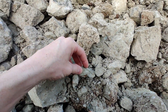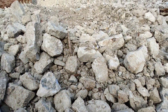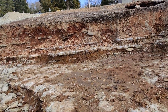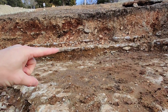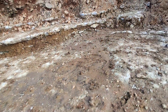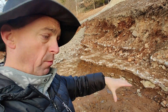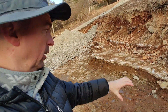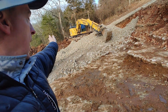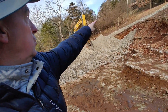This dirty rock is really good for backfilling because it compacts really well — you have all the different aggregates, from bigger ones to smaller ones. Even just sitting here overnight, it's amazing how it almost sets up like concrete. We're going to bring it up to this elevation, and then we'll use smaller aggregate up higher because part of the basement will have our plumbing — we need about 18 inches to put our sanitary sewer line. Our septic system will be out just right over there and the leach field will be up over there.